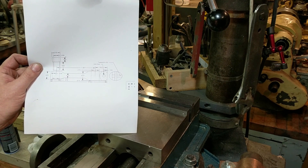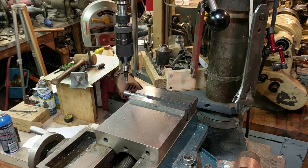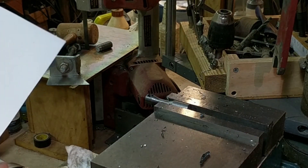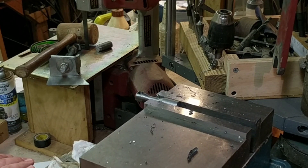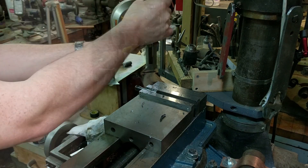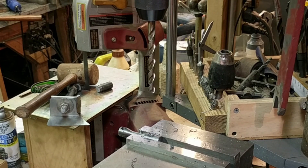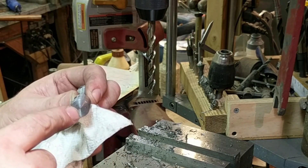My first hole is going to be at 0.236 over, and I'll proceed with this hole. All we need now is another hole in the same plane that's 1.801 away, and I'm moving over until I reach 1.801. In a perfect world this would be a 3.8 reamed hole but I don't have a 3.8 reamer, so it is what it is. Those should now be the correct offset and we just need to turn this into a clamp.